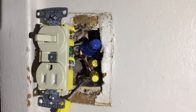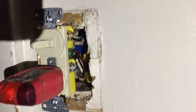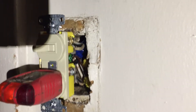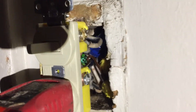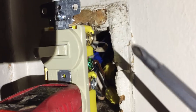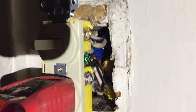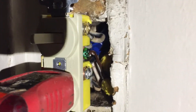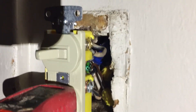This one is a hot mess, but I was correct where I put the light switch — I didn't have to change anything. Even though this wire is yellow and this is white, you would think you put your hot there and your neutral on the other side of the switch. It says 'active line' — and there's a big difference between line and load. You see this on GFCIs a lot. People call them GFI but it's actually called a ground fault circuit interrupter, GFCI.